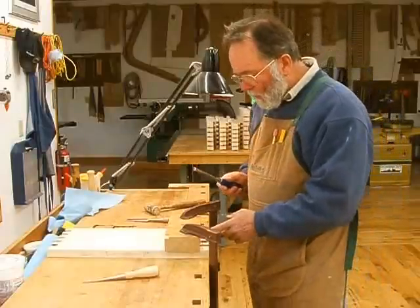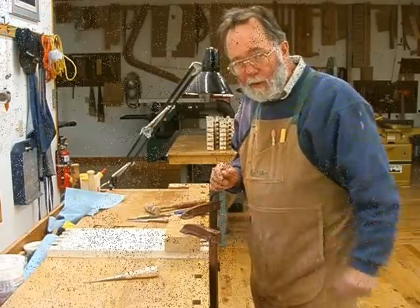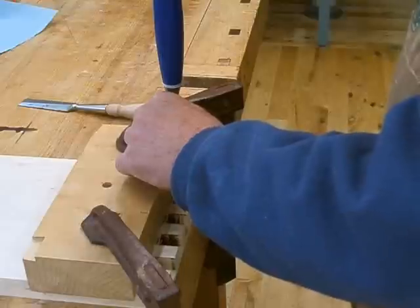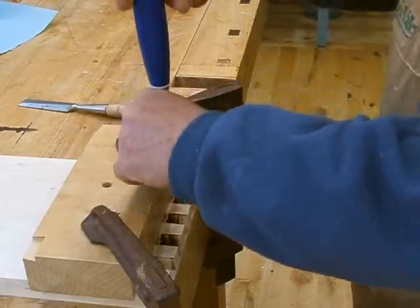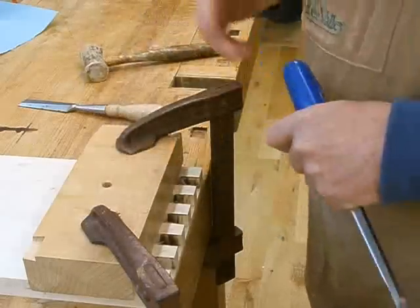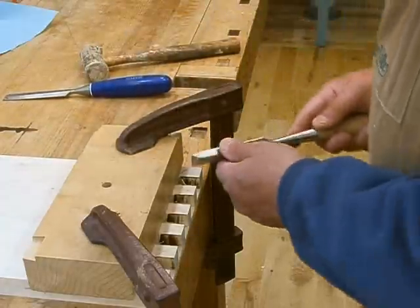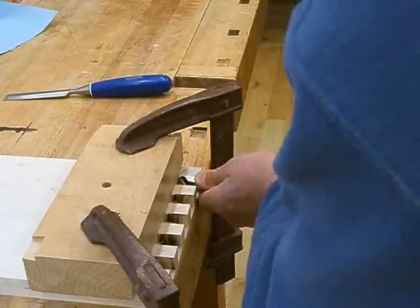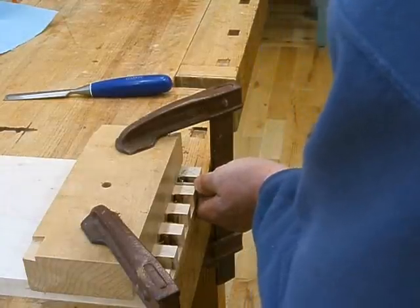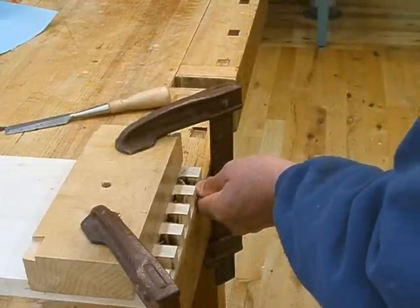Now I'm going to be cutting out this waste — we're also going to be cutting into the sides. I'll move the camera closer so you can see the work better. Like I said earlier, I just started the cut for the waste and I'm going to go ahead and finish that now. If I hadn't already cut out the majority of the waste I'd be working and working to get done what I just did here in a few strokes. I'm going to take a wider chisel and get some of this waste out of the way. I'm not doing the fine cuts just yet — just trying to get the big pieces out so I can do the fine work last.